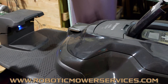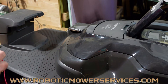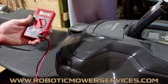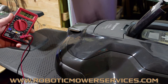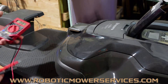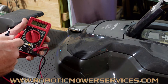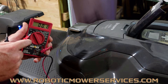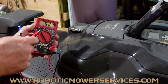After that, you want to get yourself a multimeter. You don't have to spend a ton of money on a high-dollar multimeter — you're just going to check for basic voltage here. One of these cheap ones from your local hardware store or Harbor Freight will work fine. The transformer puts out 28 DC volts, so you want to set your multimeter to DC volts at the next higher setting above 28, which happens to be 200. So DC volts at 200 — that's where we're going.